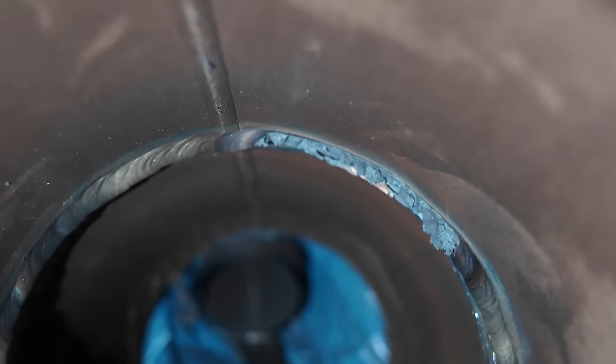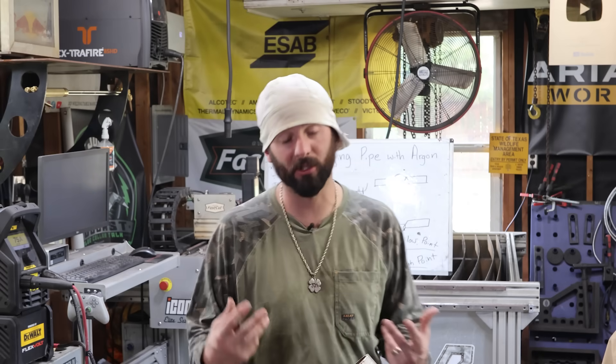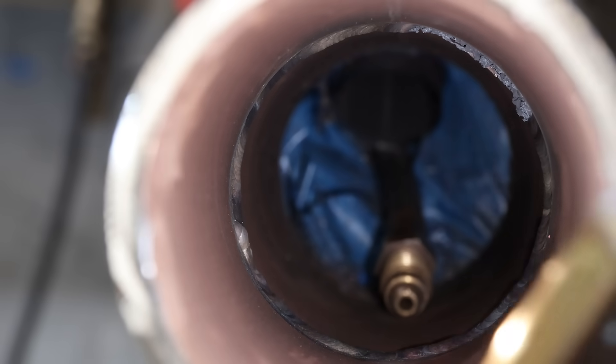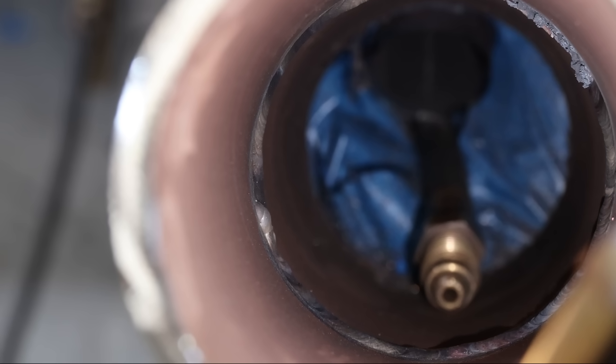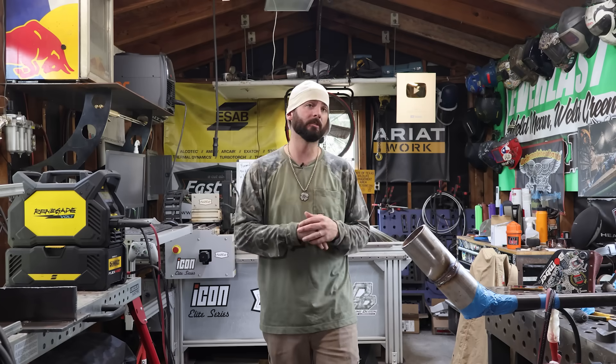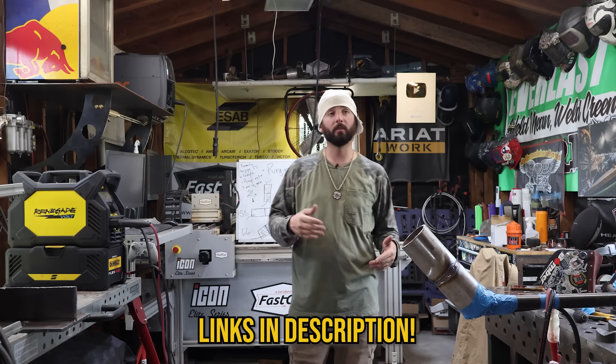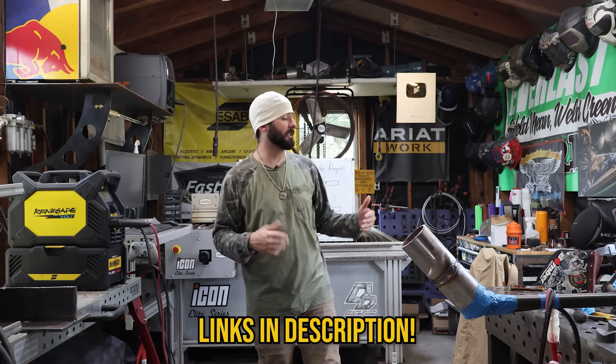Now that is what's called sugar. It's pretty obvious that it's there. You can kind of tell when it starts to set in on your root passes — your root should have some colors or hues to it. If perfectly purged, you should have a nice silver color. We've got the sugar on top and not a good tie-in down at the bottom. This video was to teach you how to purge and handle your tacks. As you get to them, feather those tacks paper thin. If you can do bridge tacks, do those — you won't have to worry about burrs or heavy lumps you didn't tie into. Check out the description below for our partners: ESAB, Heavy Hitters TIG Rigs, Outlaw Leather, and Ariat FR. We'll see you in the next weld.